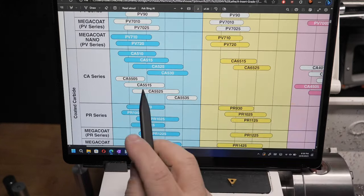I'm not convinced these are the best finishes I can get. I could probably get something better as well if I keep working at it. But overall, I'm pleased that I've improved my work here. And one of the lessons is keep your speeds up. These are all at 900 to 1250. As I was testing it, I actually ran the lathe at 300, 600, 900, and 1200 when I did these cuts. And in all cases, the 900 and 1200 were the better cuts, both for the steel and the aluminium.